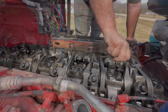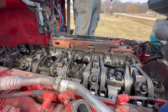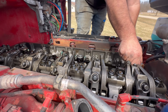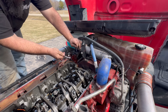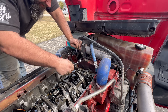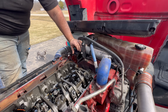That's what we want. Why is it not good to have a tight engine? Fuel mileage. If you have a valve hanging open just slightly and the valves are really tight, you're going to get poor fuel mileage and everything is going to perform poorly - you want to have that play. Jam nut for the Jakes is a half inch. The adjuster nut is a two-and-a-half millimeter Allen.